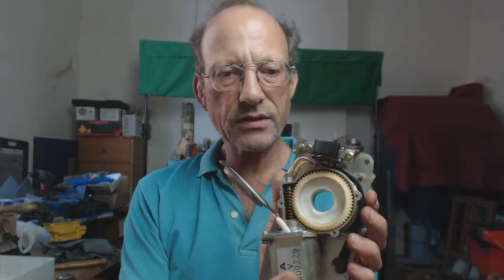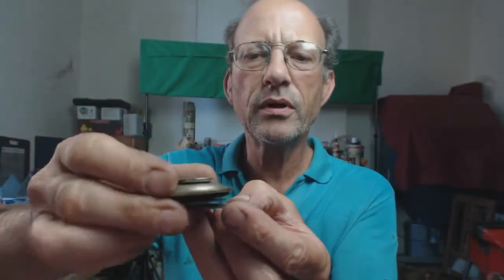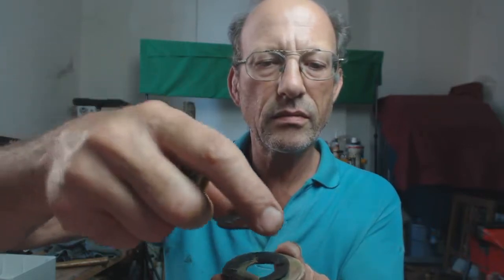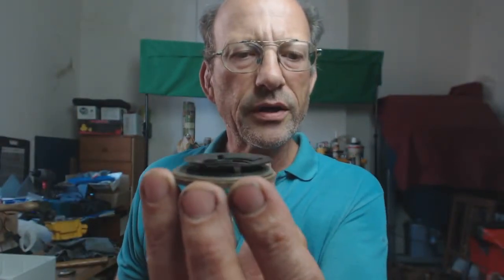There is a clutch as well. Here's how it's assembled: there's the clutch material, the bottom, then a pressure washer, and then the springs. When I took the dismantled one to pieces, the springs were nested inside each other. But the one that hadn't been dismantled has the springs opposing each other — and that's how it's meant to be. So that was a useful discovery.